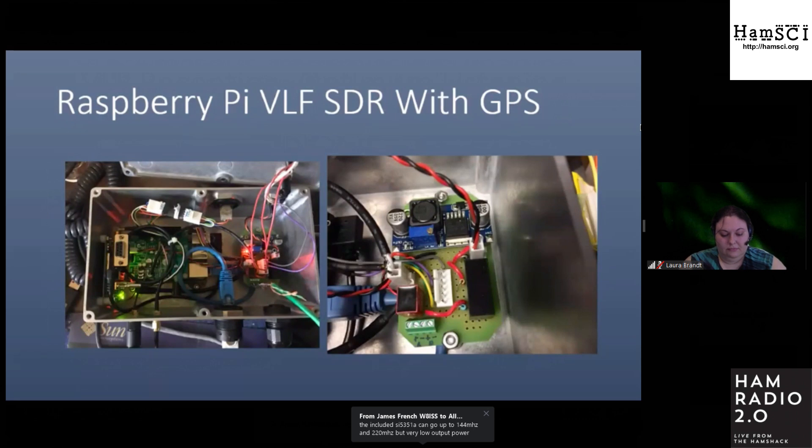The pulse per second output from a Trimble RES SMT 360 GPS timing receiver connects to one channel of the sound card for signal timestamping as well as a GPIO pin for disciplining NTPD. VLFRX Tools runs on the Pi and performs all automated functions of capturing, timestamping, filtering, event detection, recording, and streaming, utilizing named circular buffers between various utility programs. It is very similar to the functionality of USGS Earthworm for seismic signal capture, event detection, and analysis. VLFRX Tools creates the necessary data for further analysis of VLF events and visualization of data with GNU plot.